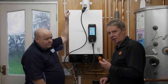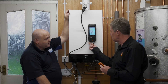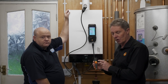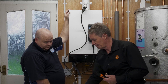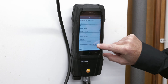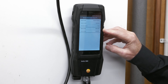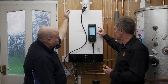Connecting the Bluetooth devices is very simple — whether it's the 510i or the 115i clamps, these connect via the little adapter at the bottom, which has to be plugged into the instrument. On the devices there's no pairing required; just switch them on. Initially they flash an orange light, then go green when they're pairing with the device. In the instrument you go into the screen, look at device information for smart probes, and it will show the devices as they connect — the 510i and both clamps appearing in turn.